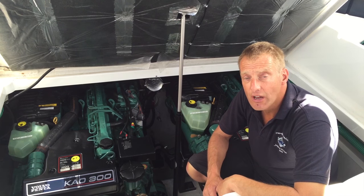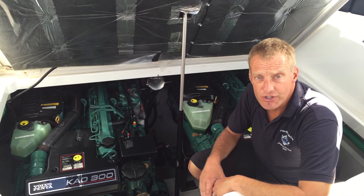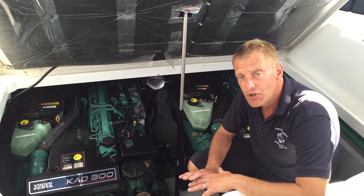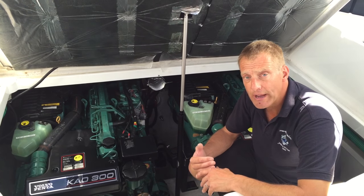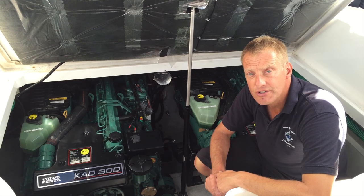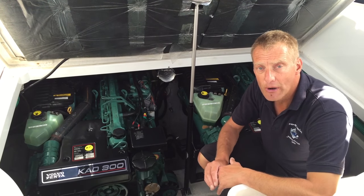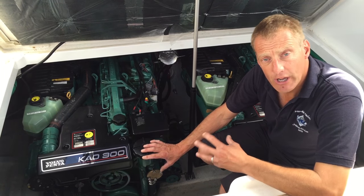The dreaded overheat alarm has gone off. I've opened up the engine bay and the engine is overheating. I suspect the impeller. I haven't turned the engine off yet because first I want to ease it back to neutral and put a hand on the faceplate of the pump. If it feels stone cold, the impeller is not the issue. If it feels hot — and touching it very gently it almost certainly is — the impeller's gone.